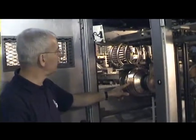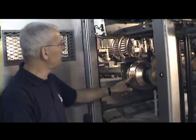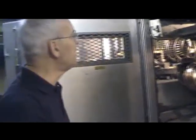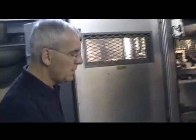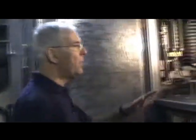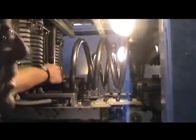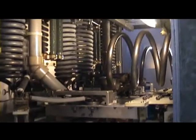This peculiar thing here is a fixed capacitor, value 1000 pF, glass, made by Jennings in 1963 — one we haven't broken. You can see the large transformers underneath to supply current to the tubes. Out of the anode via that capacitor, we hit the filaments again via another plug-in coil, and we hit the filaments of the output stage.